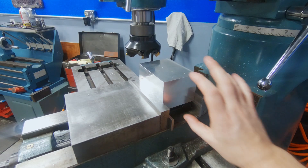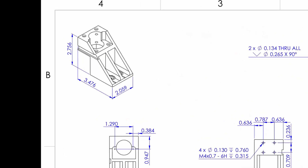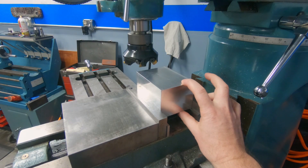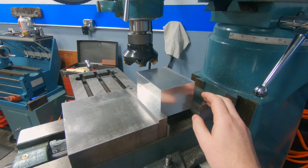Now it's time to cut this width to final size. Looking at the blueprint, the overall dimensions are 2.756 by 3.476 by 2.059 inches. These numbers may seem arbitrary at first, but they're converted from metric. Because the printer is assembled with metric components and prints in metric units, it was easier to draw the part in metric and just have the software convert to inches when dimensioning the final part. Now that we know this measurement needs to be 2.059 inches, we can begin taking some material off.